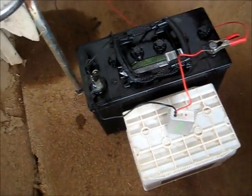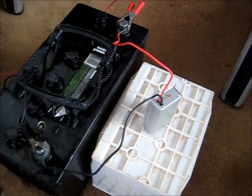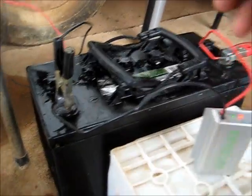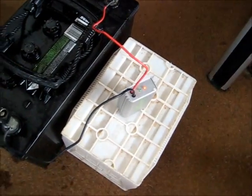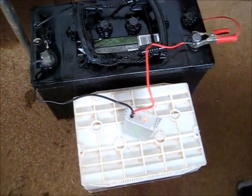I'm just going to put the desulfator on it and see what happens. I've got the desulfator hooked up — red light. Cords are plenty long enough. Power on. That red light means the battery's completely dead, or below 12 volts. The green light's not on, so it's not desulfating yet — that's under no load. The green light has to be on for it to desulfate. I've got to try and get a good connection to see if it stores any voltage. Yeah, it does. Hopefully this will give the battery a second chance.